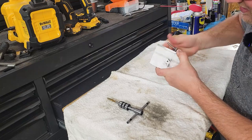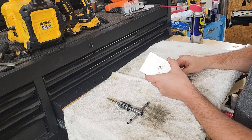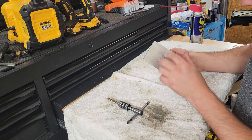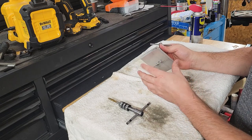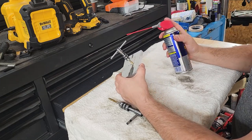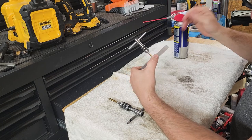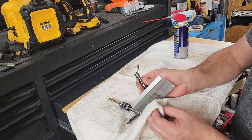You can see the nose of the tap with debris coming out — that's all good signs. As I continue the same motion, you can see what it looks like coming out the bottom. Now that the tip is through, the rest of the chips can push through the bottom and I don't have to break the chip anymore — I can just keep threading it down. This is a straight-flute tap, not a twist tap. There's going to be a lot of debris caught in those threads, so if I back it out in this condition, there's a good chance I'll mar some threads. So I like to put some fluid down through the tap to help evacuate those chips out the bottom — you can see a lot of chips bleeding down at the end of the tap.